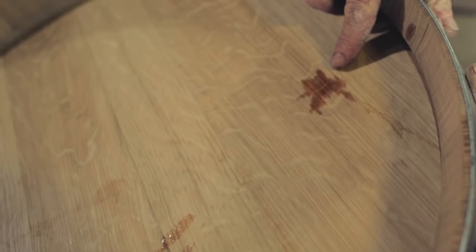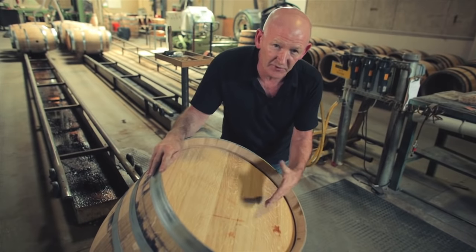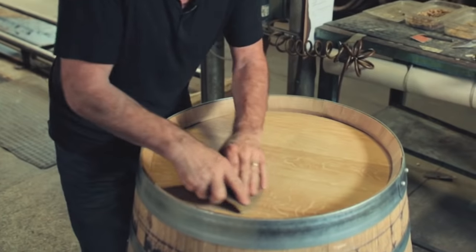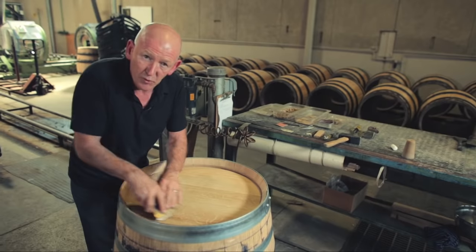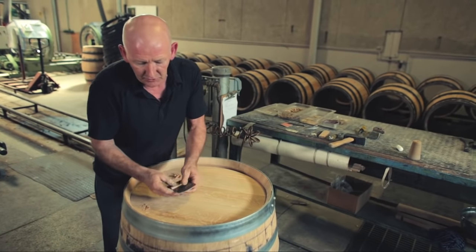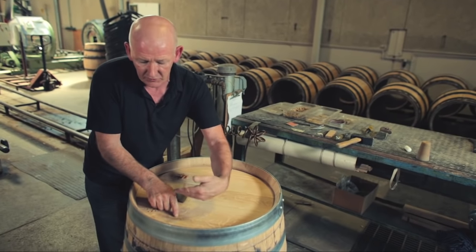You can see on the other head of the barrel we have a grain leak on the head. So this is a completely different fix from what we just did on the other side. I'm going to scrape the wood here — this direction is smooth, so that means I'm going with the grain. The opposite direction is rough, so I'm going against the grain. So I know to fix this particular type of leak, I have to go with the direction of the grain.